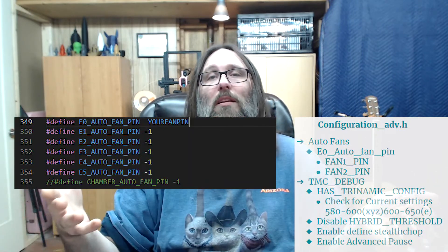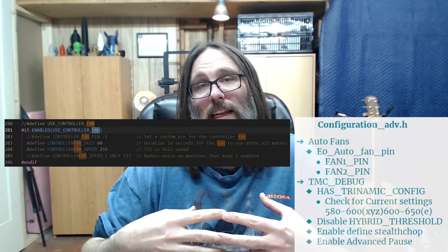Once you have Configuration.h set up with your board type in, we're ready to go to the advanced configuration. The first thing on my checklist there is auto fans — I love them. The auto fans turn on and off when one of the controllable heating systems gets above a temperature, so you need a thermistor attached to something that gets hot. Another cool use is the controller board fan, which turns on when steppers are in motion and off when they're idle — or even better, use a thermistor inside the controller board enclosure as a chamber fan.